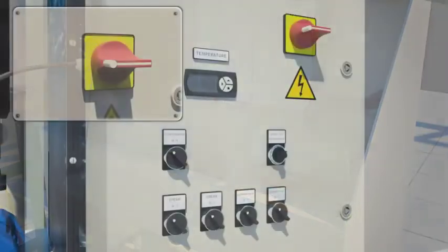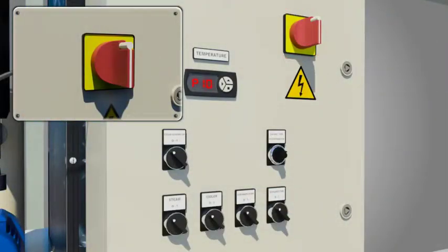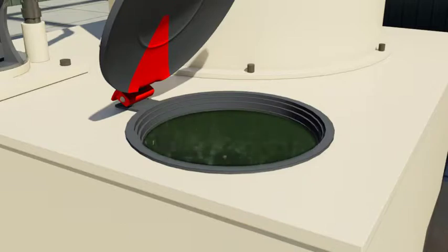The process starts by startup of the pump and blower in the scrubber, which is done from the main panel board attached to the Aqua Regia unit. Once the pump is started, the circulation of scrubbing liquid, mainly caustic soda, is started. This ensures safety towards absorption of NOx and acidic fumes generated during Aqua Regia and reduction processes.